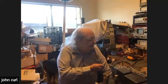When you have an amplifier and a resistive load, like we're testing here, just an 8-ohm or 4-ohm resistor, or 16, whatever, I have just a resistor. But a loudspeaker is not a resistor. A loudspeaker changes from 2 ohms to 10 ohms and then back to 5 ohms, and on and on all through the audio spectrum. And dynamically, when it's playing, sometimes the cone is going in a forward direction and then it's told by the amplifier to reverse direction. It can't reverse that quickly, so it'll put out its own garbage, which then goes through the feedback loop and everything.